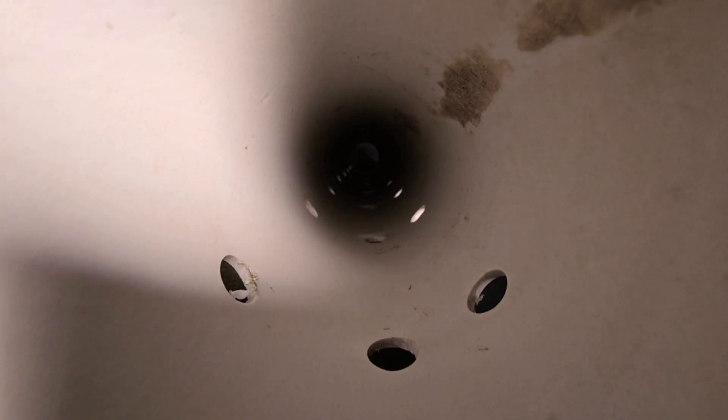There's nothing to vent this pipe. So up top in this pipe, you end up with a lot of condensation buildup. When temperatures change, there's nothing to vent this pipe up top, so it builds condensation. Anytime you have a change in temperature, you're going to move air through the system. The ground stays a certain temperature for a while — it doesn't change as fast as the air. So you get condensation at the top of the pipe. There are many things that grow in the dark when you have a non-vented system.